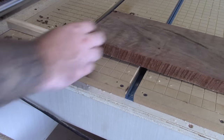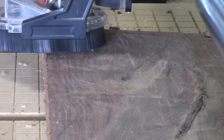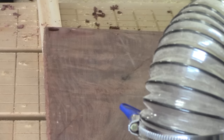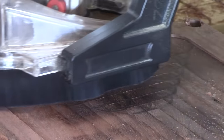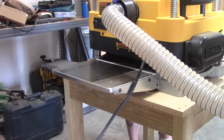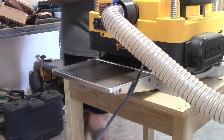I'm going to use a shim to hold up that edge so that it will surface to a nice flat surface, and then we just let it run. You'll notice right here I may need to adjust my feeds and speeds, because every time that surfacing bit stops in a corner it's leaving a little burn mark. I can plane that off and I will, but I want to eliminate that. Since I have one flat surface, I'll move over to my planer and plane the other side to get it down to the thickness that I want.